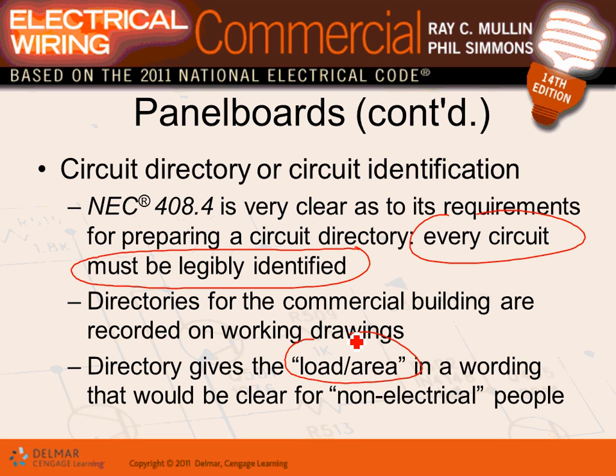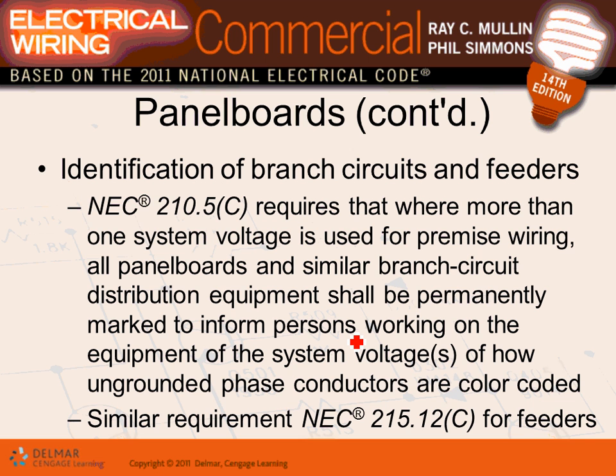That's part of it. But I'm not kidding you. The code requires you not to name these circuits based on what they call transient names, like people's names. You could be fired and hired. Hurts our feelings, right? But you can't name it that way. You have to give it a proper name, like this is called Red 10. It's not Chad's lab, because Chad moves to a different lab, Polly comes here, and after a couple of years nobody knows where Chad's lab is. And believe it or not, that's required by code. So you can't have a transient name that changes.